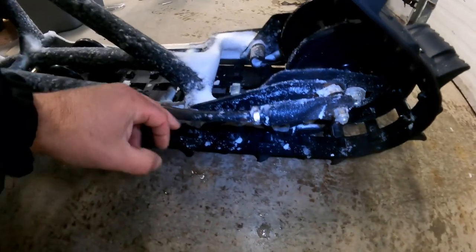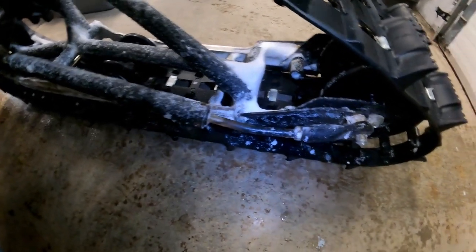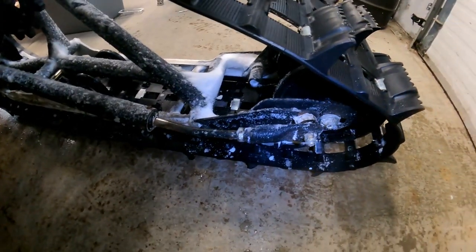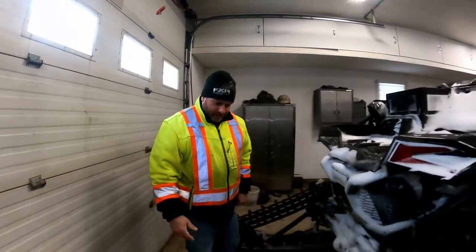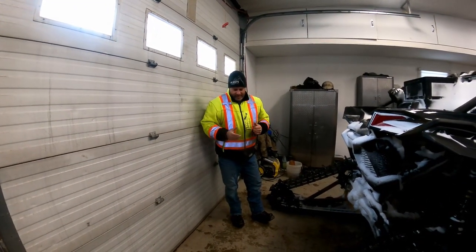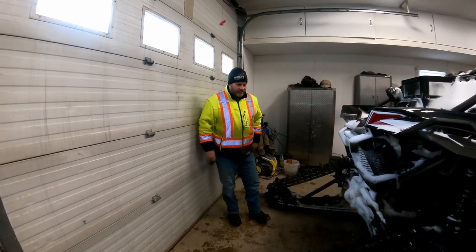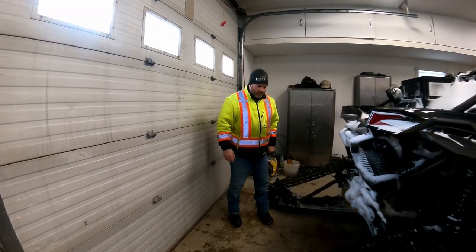It bent like this as well. Now I've got to take this thing out, put it in the vise, unbolt this one, unbolt underneath here, put it in the vise and straighten it back out. It's steel, so if it flexes like that it doesn't snap or stretch — you can put it in the vise and re-straighten it to about 98% accuracy, which is fine.